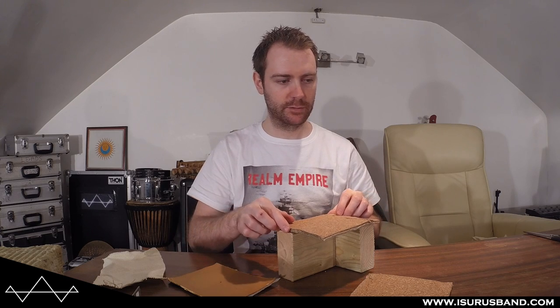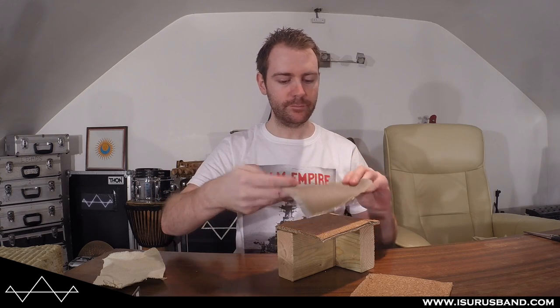We used two screws going through each corner and then metal brackets on the inside, screwed in. So basically, looking at a corner of one of the rectangular modules, you'd have the wood, then a layer of plasterboard covering the whole rectangle, then a layer of Tech 50 — the mass-loaded vinyl type product — and then another layer of plasterboard over the top. These modules would bolt together: the bolt goes through and connects one to the next, and so on, same for the roof.